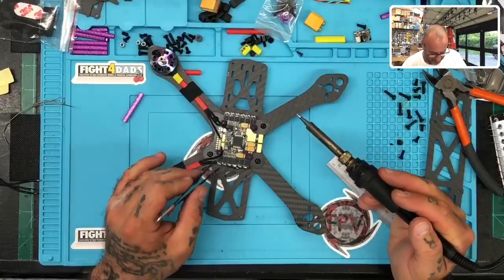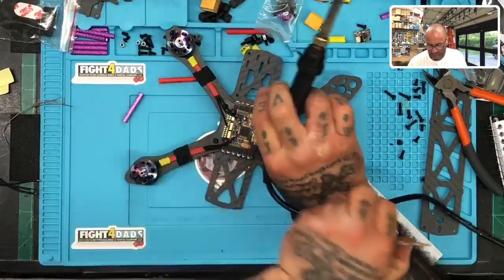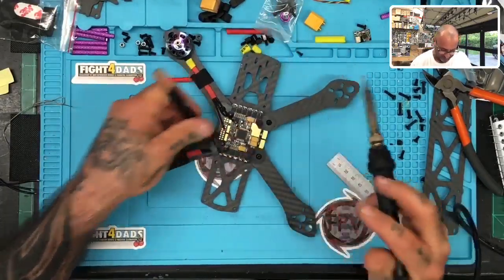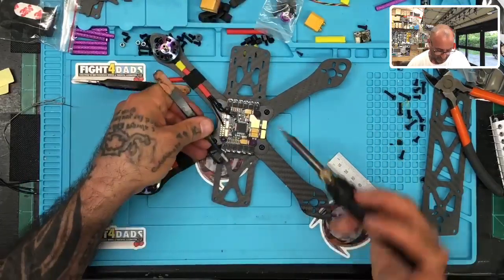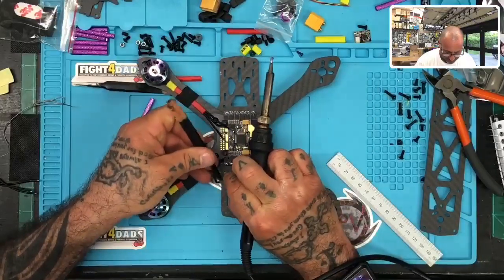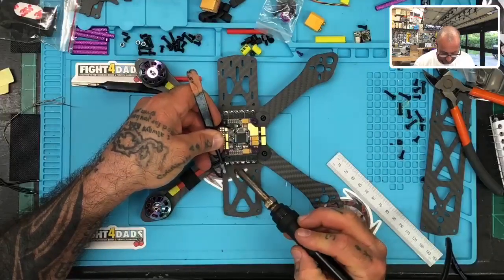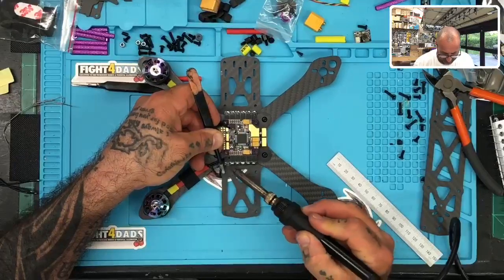So the wire, because I used the flux paste, the wires are a little slippery, so it's hard to get a grip on here, but let's see. God darn it. Try different. I've angled some of these tweezers a little different. So I'm going to offset, I'm going to turn this, right? Ideally, I'm going to turn it almost 45 degrees because I want the wire to tuck in nicely. So I'm just going to get over there and then get that on there really good.